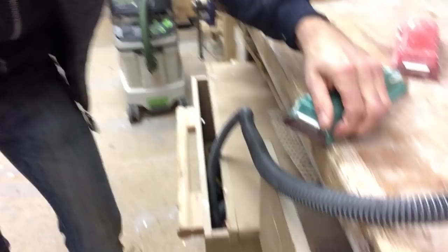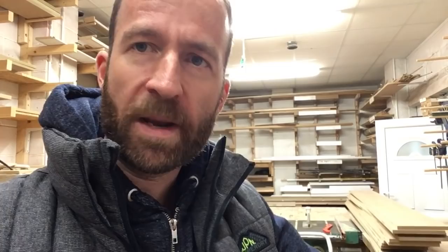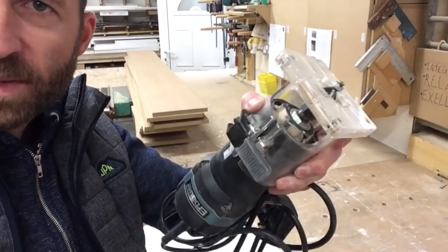That's about as good a sand as we always used to do when we were rollering. We use these — they're called Timesaver tools from America — really good sanding blocks, color coded, and they unclip easily with a nice solid mechanism and a rigid foam backer. We would typically do 120 grit then 180 grit, then chamfer the edges. We always put a little chamfer or round-over on the edges — first with a block plane, then we moved to a chamfering bit in a palm router, and then later more with the orbital sander.